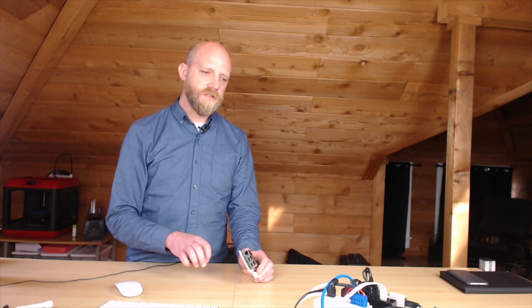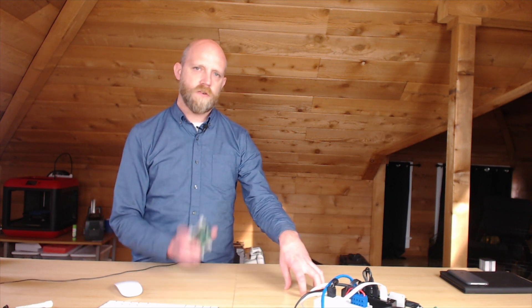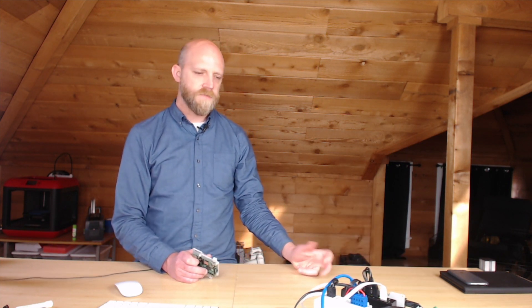In this video, I'm going to demonstrate creating a Greengrass core — the hardware device that acts as that endpoint — and then connecting WAGO controllers to that Greengrass core using WAGO's cloud connectivity suite. I'm going to use a Raspberry Pi as my core. I have two PFC 100s that will connect as GGADs, or Greengrass-aware devices. Hardware is set up — let's get programming.